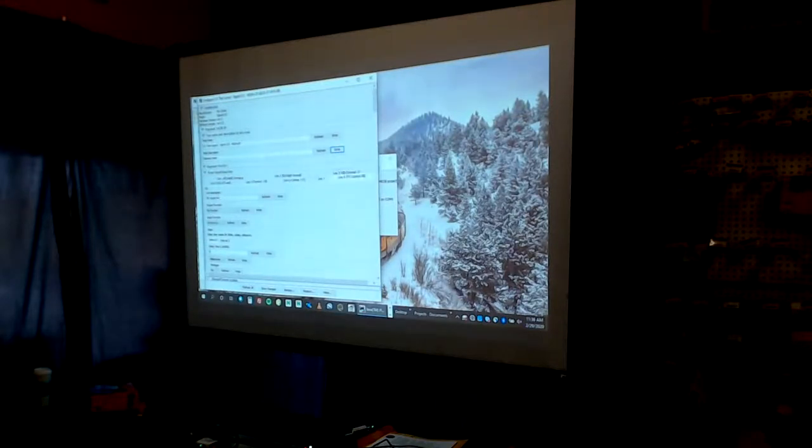So for instance, on the push button, I've got the description, turnout control push button. Oh, this is really hard, isn't it? Output function. Is there an output function on a push button? Pop quiz. Is a push button an input or an output? No, it's an output because you're completing a circuit, right? Is it an input to the logic or an output of the logic? It's an input. It's an input to the logic. So there's no function. And this is actually an input function. It's not an output. This is kind of cool, by the way.